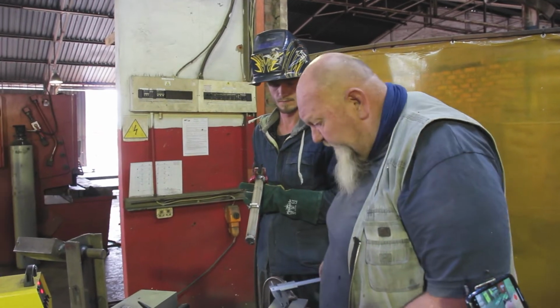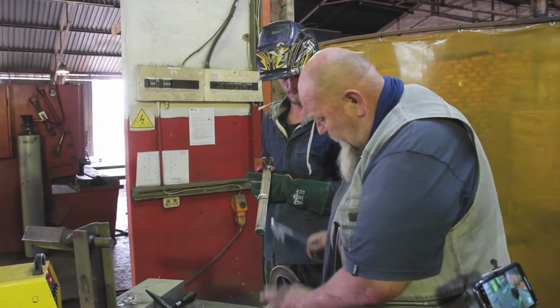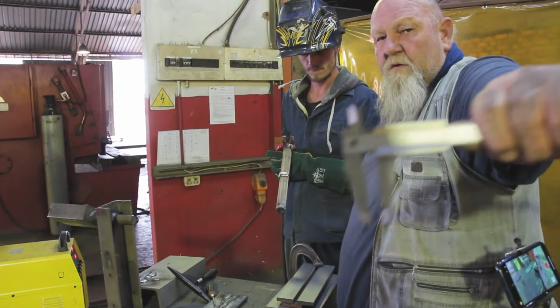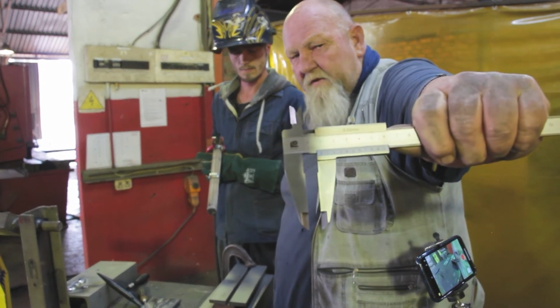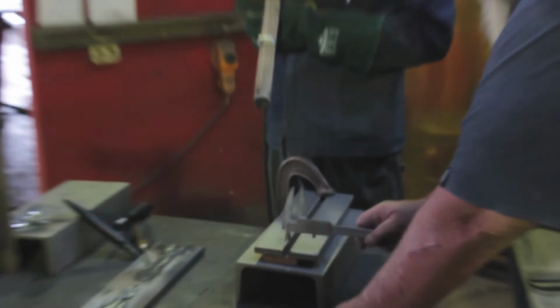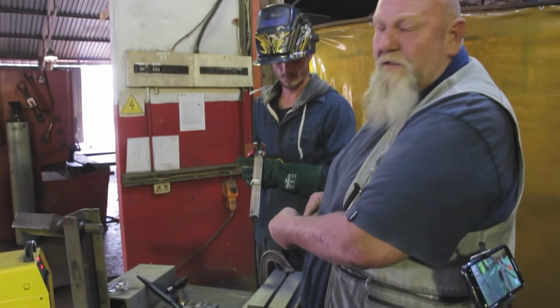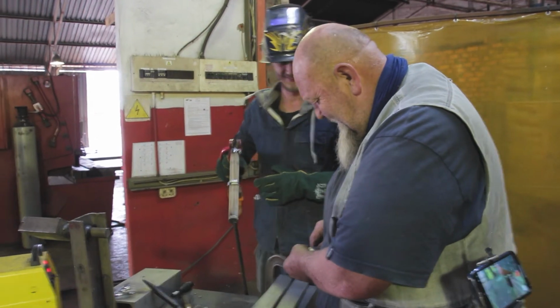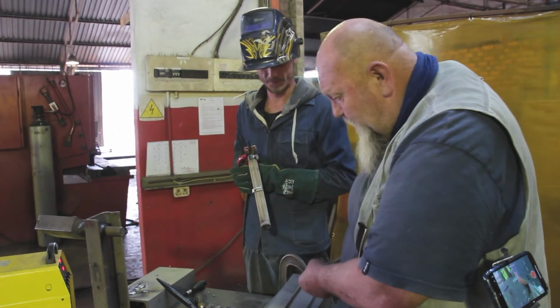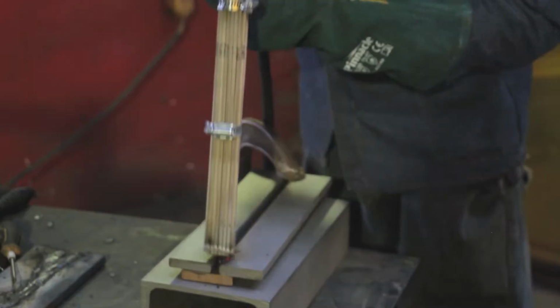Right, we set up for the filler weld. We've got the copper plate in the bottom, we've got it clamped up, we've got a 10 mil gap. For our American friends, that's 3/8 in a bit. Let's see if it'll make a pool. The floor is yours, sir.